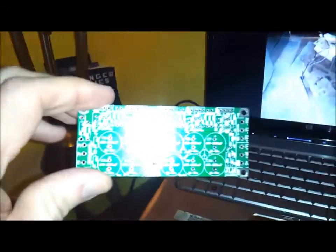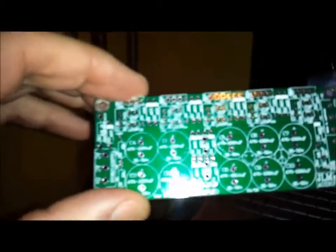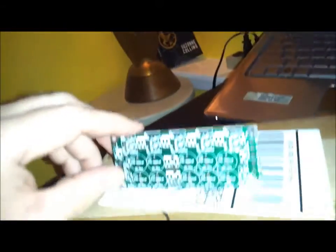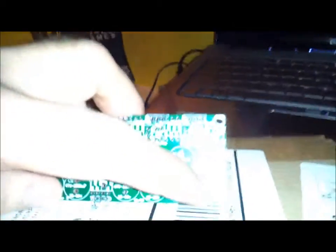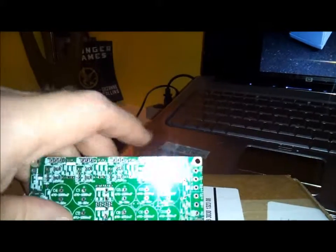The first thing is this PCB from JLM Audio — and it is tiny. I was really shocked how small this was. He has a lot of pictures on his website but just didn't get the impression it was this small. It's actually about the same size as the Jameco PCB that I bought, but this one actually has more rails. The Jameco had two rails plus minus and the zero reference — so three — while this one has zero, plus 48, V1+, V2+, V1-, V2-. So it's got six rails as opposed to three.